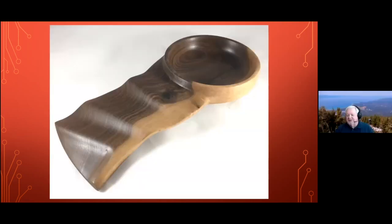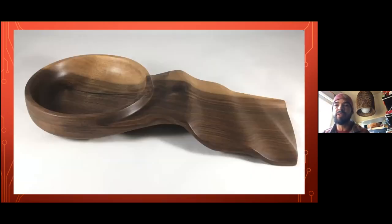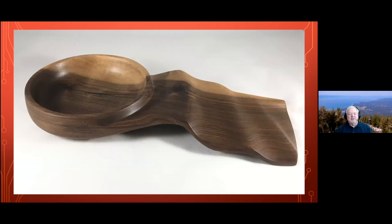Michael Hackett, followed by Vern. This is a piece of walnut I got from John Cobb at a barbecue — they were supposed to be rifle butts, so they're all long pieces. This is the first piece I've done more hand carving on. The center line from the bowl to the arc at the bottom is nine inches and fifteen-sixteenths — anybody with a 20-inch lathe realizes that is right down to the bed. I used a master carver and a lot of rasp work as well. It's interesting what simple designs require so much work to create, but it came out very nicely.